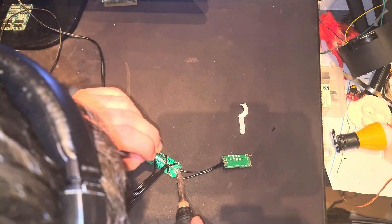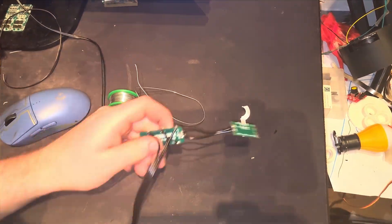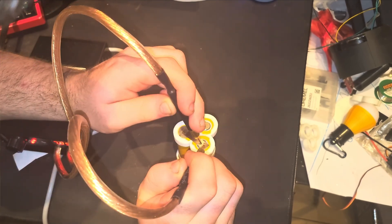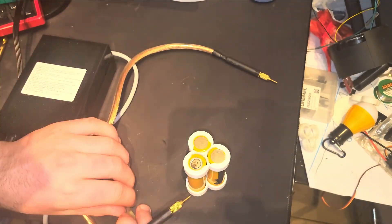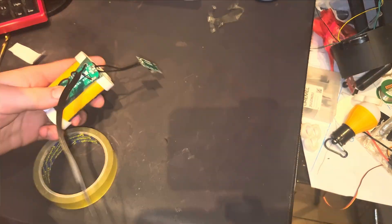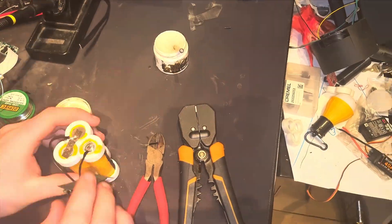All that's required now is for me to order the parts and assemble the electronics. This is not as easy as it looks. For some of the parts, I could order them off AliExpress. However, for the large majority of them, I couldn't, so I had them made and assembled at PCBWay. I'm not going to waste my time trying to solder tiny components onto circuit boards when I can just get someone who can actually do it with the proper equipment. As for the battery I'm using, it's three 21700 cells from a Chinese company that were very cheap. They have a rated capacity of 5000 mAh.